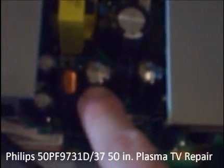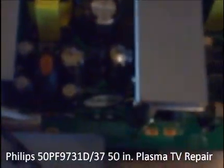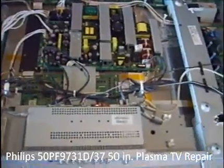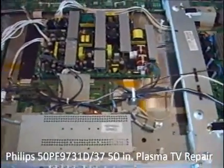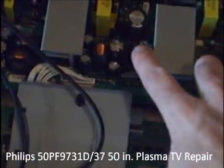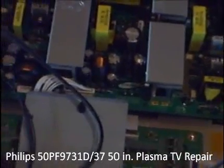You got this one and this one. The common problem — and probably with a lot of other flat TVs, LCD TVs, plasma TVs — is when you get a power surge, these two capacitors here have a tendency to blow out.